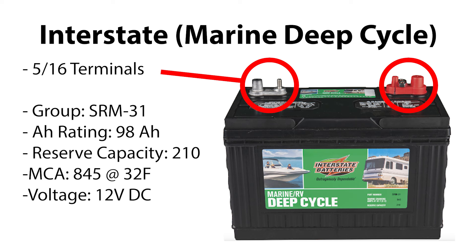Before we get started, here's the most important piece of advice I can give you: use quality marine-grade components in your installation. That means marine-grade tinned wire, good solid crimped connections, and most importantly, take the time to plan out and even draw out the system you want to install. A little prior proper planning goes a long way — there's no increase in wire size or number of ferrite beads that's going to help you overcome a bad installation job.